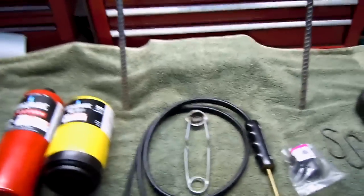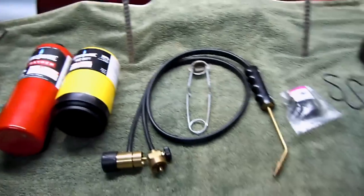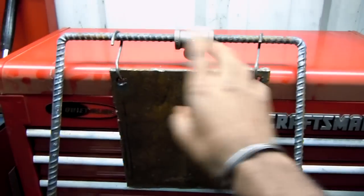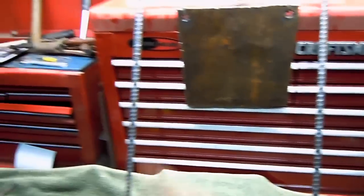For the main component you're going to need rebar. Here I have a 10-foot piece as well as a 5-foot piece. This one on the right is a 5-foot piece because we'd already cut one apart to make this one. Also, you'll probably need a tool to cut the rebar, or you can buy it from Home Depot pre-cut — that's probably a good option. The first thing I should explain is this is a 5-foot piece overall. We're going to bend it at the 2-foot mark, and the other side at the 2-foot mark, and leave about a foot in between. It won't be exact, but that's the rough dimensions. So each leg is about 2 feet tall and the width is about a foot — actually like 14 inches, and the legs are like 23 inches.